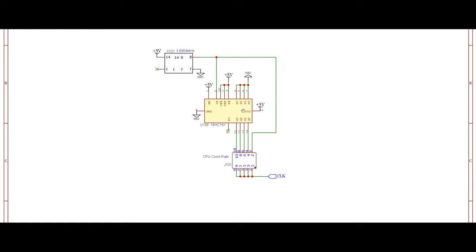And you may ask, okay, what's the point of having a binary counter in the middle of a clock circuit? Well, the point here is that we are using this binary counter as a clock divider. Essentially, we are changing the original clock speed to a lower speed using a binary counter. So let's see how it works. A 4-bit binary counter, as you may know, has some inputs and some outputs and, of course, some control signals or control pins, right?